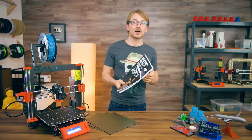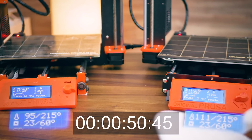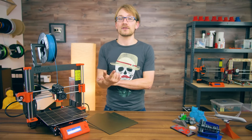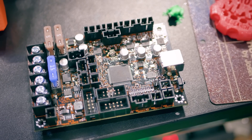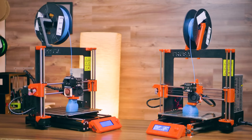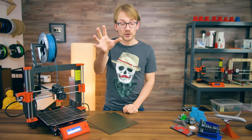The MK2 came with a very similar guide, but it didn't come with this new spool holder — which works with almost every type of spool — and it also wasn't a 24-volt system. 24V means lower currents, more efficient power handling, faster heat-up times, and slightly higher maximum temperatures on the heated bed. The new electronics, the Einsy board, are built with 24V in mind and use the Trinamic drivers onboard. They're still manufactured by Ultimachine, still open-source, and you can buy it separately from Ultimachine directly. It's still an 8-bit microcontroller, but looking at what Prusa's developers are pulling off with just this chip makes me wonder whether we actually need a 32-bit platform for performance alone. The MK3 does print slightly faster than the MK2 and this board isn't limiting performance, but I do think the next generation needs to be 32-bit, even just for integrating network functionality.